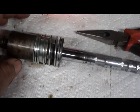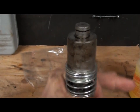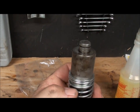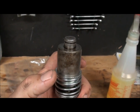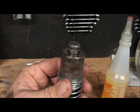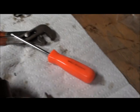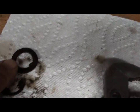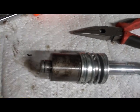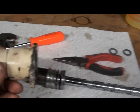Obviously I can't change the ones that are under here now because they're gone. But anyways, it seems like this spring — if you just stand this on end and compress this down, the ball bearings that go underneath will be exposed. So if you compress this somehow, and then put a new spring in, put the bearings in, squeeze them, and slide that back up, it'll go on just like this did. Now that this cap is on, we're going to take this part here, slide that over everything, and then there's a little washer and a C-clip that go on around here. Now this whole thing will be all together, and I can slide that all in as one unit, and then just screw it back in.